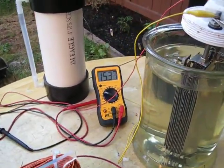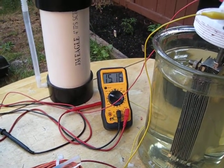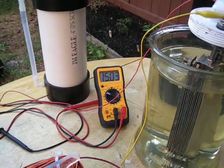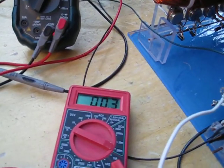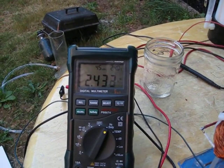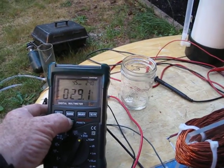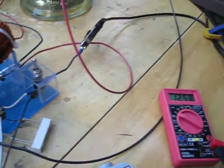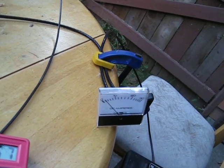You can see what the cell voltage is jumping up to — 15.3 — now it's settling back down. We're drawing about 300 milliamps on the trigger side. Frequency is 2.437, duty cycle is 29.1. And we're pulling just a little heavy on 2 amps.